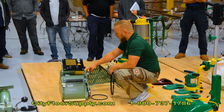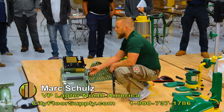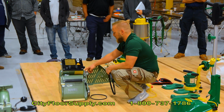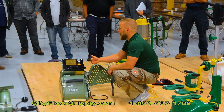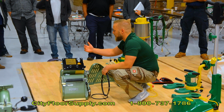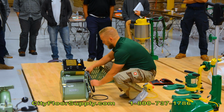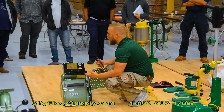If your belt runs on ground, it heats up the pulley. Sometimes we've seen the color change of steel, it turns blue. And as I said, the worn out pulley damages your belt, damages your bearings and the entire assembly. So a $10 piece could cost a $500–600 damage. So make sure to have a set of belts in the van. If you change out belts, change out both belts.